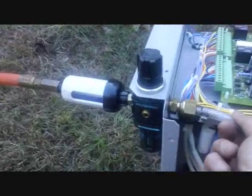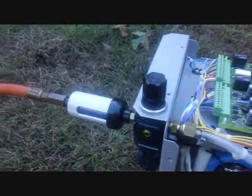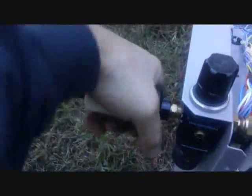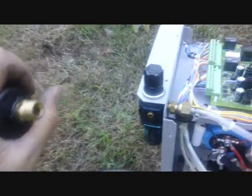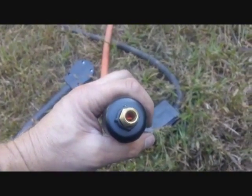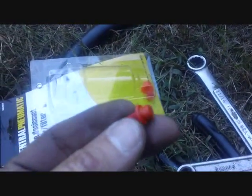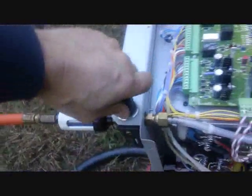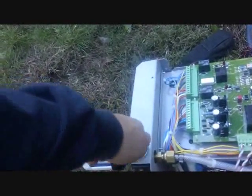There's your problem right there. I've got this line completely loosened at the compression fitting and there's not any air coming out. But when I loosen this other side — oh man, do I feel dumb. There's a little red plastic doohickey down in there, and that's what's blocking this thing. When I unpacked this air dryer, I pulled out two plugs, but what I missed was a third one. Because I cranked this thing so much toward the plus side, I'm going to back it all the way back down before I put my air back on, just in case.